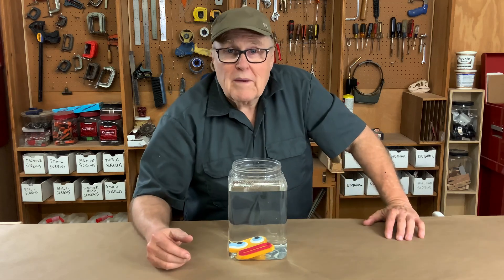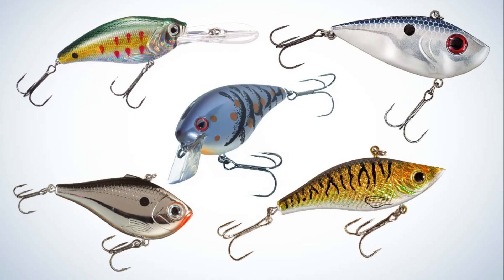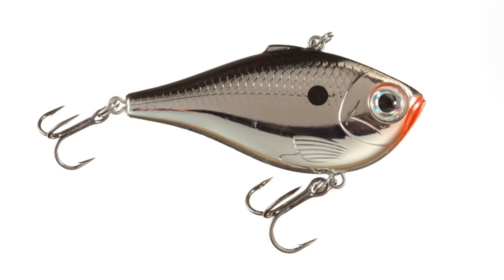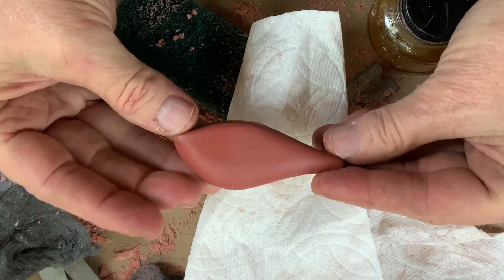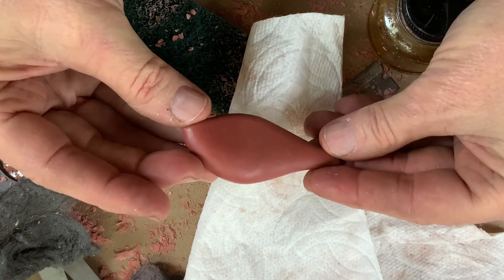What can you do if you want to make a casting that floats? A fishing lure is a great object for this project. I particularly like this one made by Rapala — I like the shape. It's simple, it's clean, and easy to carve, and it'll make a perfect subject for this project. So I carved it out of sculptor's wax and set it up for casting with a funnel, sprue, and vent.